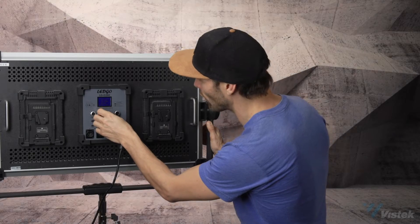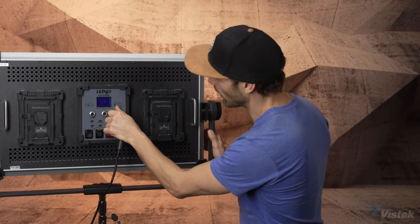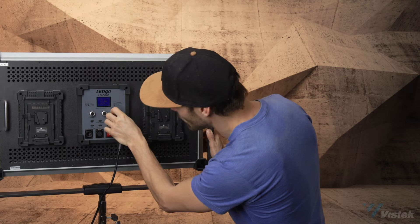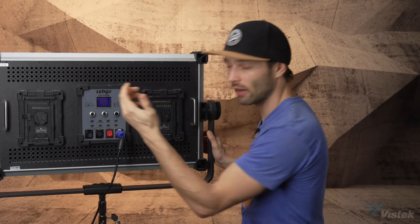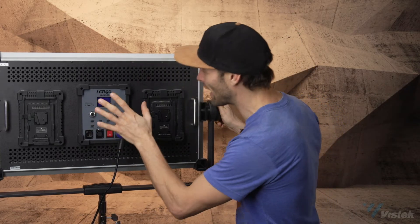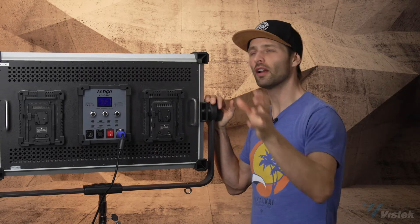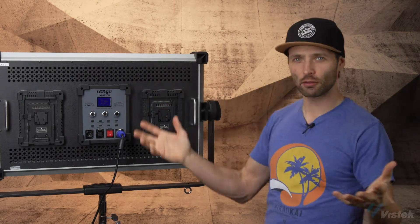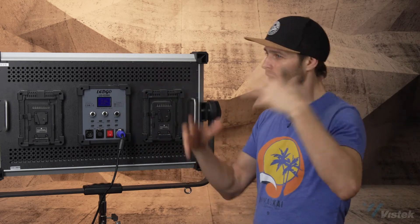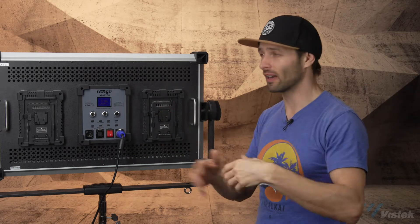What's unique about this light because it's full RGB is that I can actually swing my green to magenta — I can go one way for magenta and the other way for green. So it's really useful if you're trying to balance with overhead fluorescents, which can skew either magenta or green depending on a multitude of factors. That's really one of the advantages of RGB — it's not just for creating color effects, but you can actually pinpoint specific colors and adjust for the environment you're in. In a factory, for example, you can match this key light to the overhead lights' exact color, white balance your camera to that, and it'll look amazing.